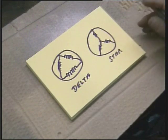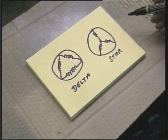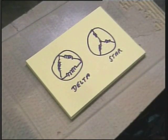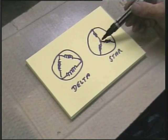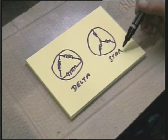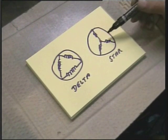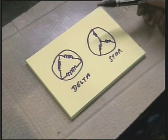OK. There are two possibilities as to how your motor may be wired up. It may be wired up as the original generator in the power station — this we call delta. Or it may have each of the three windings connected to a center tab, which is known as the neutral. This is called a star, because it looks like a star. I prefer to work with the star configuration rather than the delta configuration. You can run both, but they take different approaches.